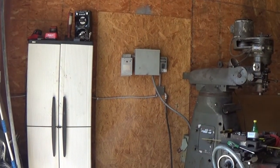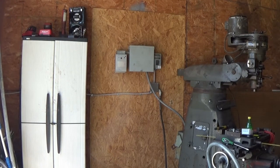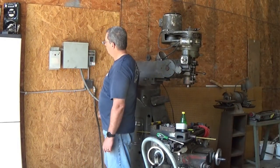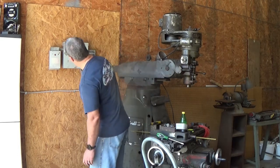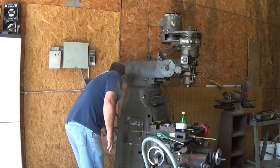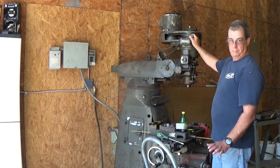Panel's all back together. We've got 220 going in — we know that because we've got power on the welding lead. Let's flip the breaker and see what happens. The red light should come on the static phase converter — that's the rectangle box on the left. The circuit breaker is basically just a big switch. Once we flip it and have power, I should be able to fire the milling machine up. It should fire off the static converter, so let's try it.